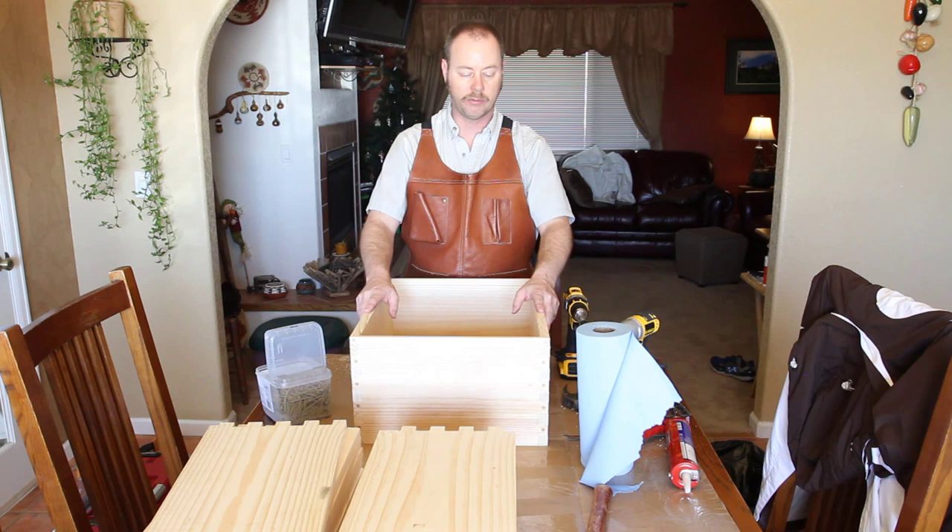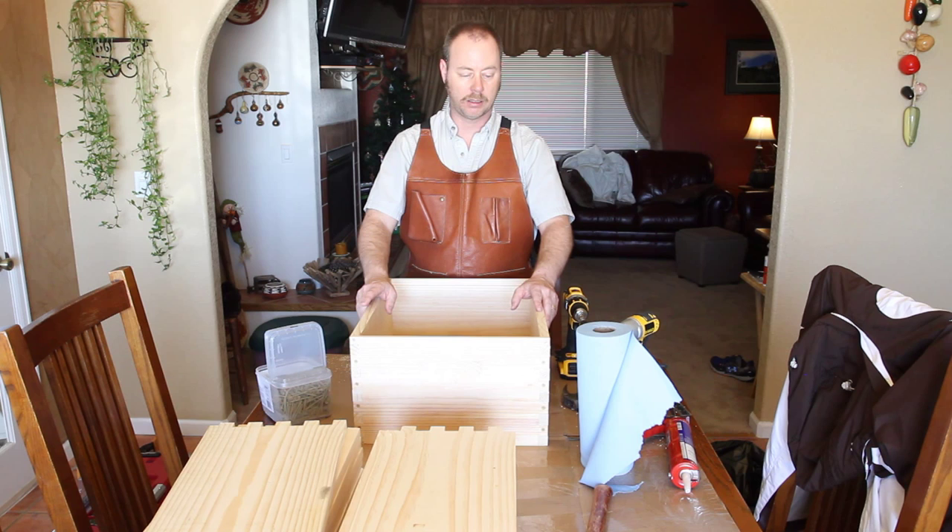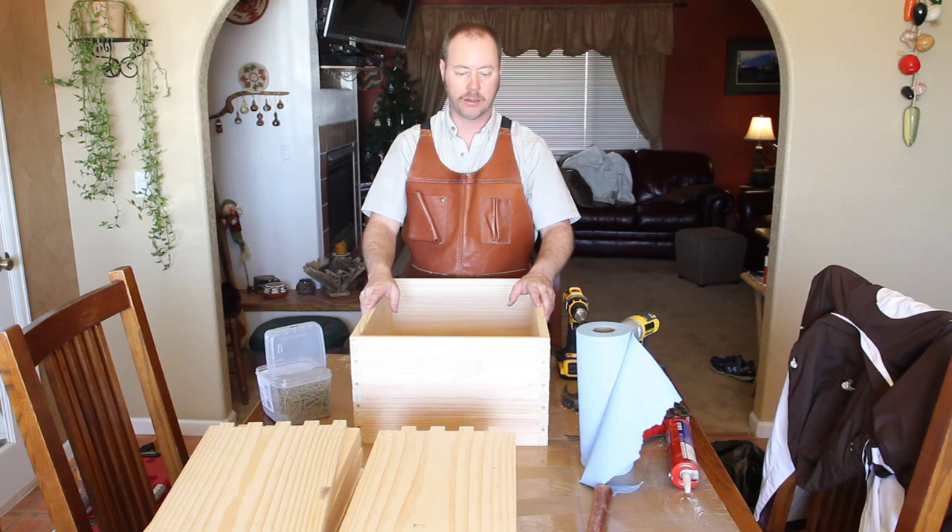There are different methods for protecting the wood. I've seen people dip in wax — not beeswax — which seems fascinating. I've tried stains with a clear coat, fiberglass resin, and Helmsman spar urethane. They didn't hold up. The fiberglass resin lasted less than a year; resin with urethane on top lasted less than two years. I eventually just sanded down the hives and repainted them. So protect your investment — use good quality paint, do it right the first time, and it'll last your lifetime.